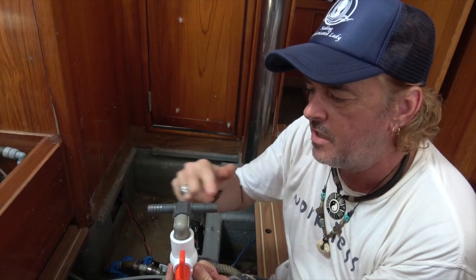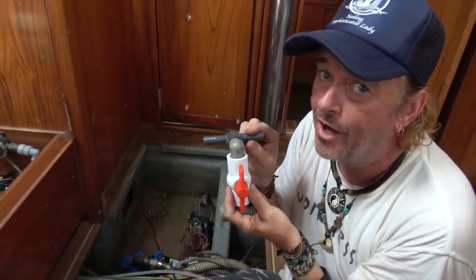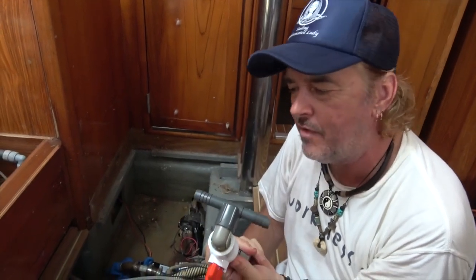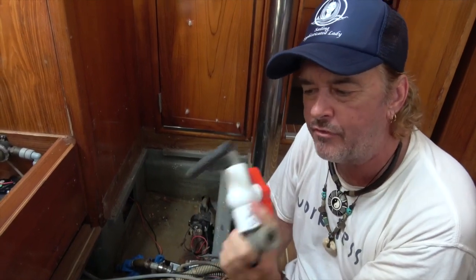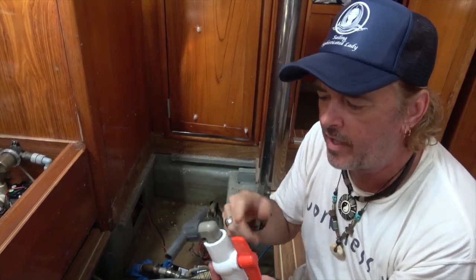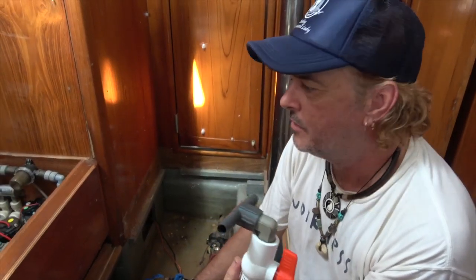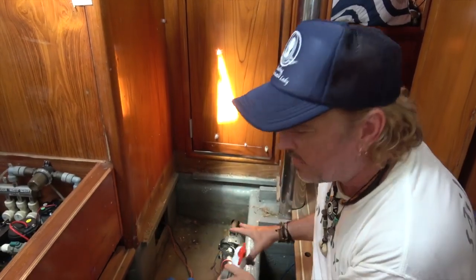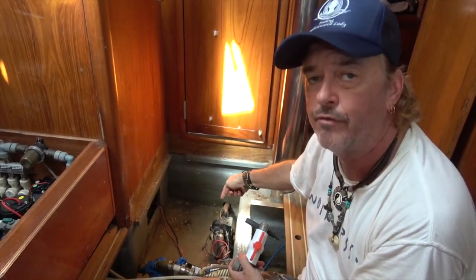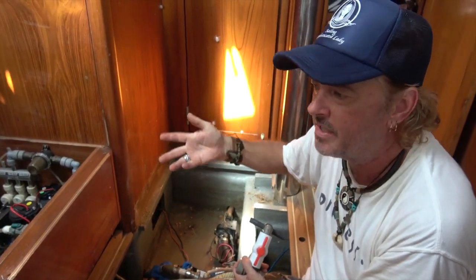There are two outlets here — one is for the flush water system on the desalinator, and the other is for our new laundry machine. Yes, we did get a laundry machine on a sailboat! We need to splice T-fittings into the existing water system for that too. Right now we couldn't get enough parts to make two of these, so I'm just using this one fitting for cold water, which covers everything needed for now. When I find another T fitting I'll hook up the hot water later — it's not a big concern. The tube that runs up to the bow locker, I'll probably end up running that off a fresh water discharge from the boat's fresh water system, so we'll have a hose up in the bow that pumps fresh water straight from our tanks.